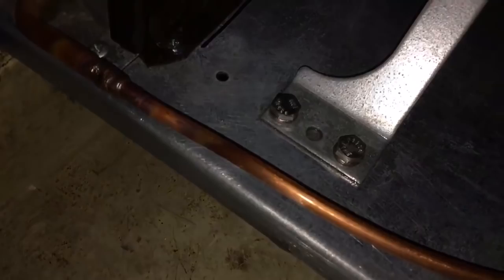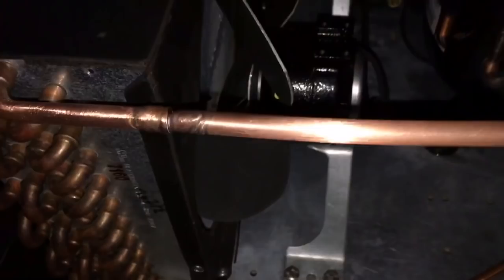I tricked it out, stainless steel, quarter 20 by half inch long, quarter 20 with lock washers, all stainless steel. I don't know if you can see. Pretty sweet. They hold stout, they're just way better. So you can get a wrench on them now, socket or something, instead of the damn Phillips. I hate those freaking Phillips.